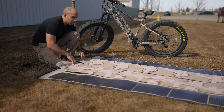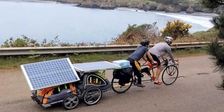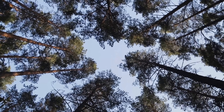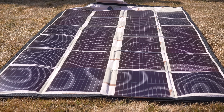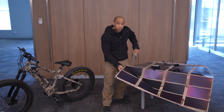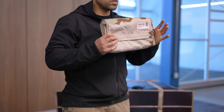Power Film is a high upfront investment. The number one benefit of a Power Film solar panel is that it's going to function in low light conditions. A lot of those monocrystalline panels — if you had a bike trailer system with one of those panels laying flat and you were biking through canopies of trees — that partial shading is going to drastically reduce their efficiency. However, with Power Film, the way they're wired and configured, this is going to perform very well in low light and partially shaded conditions. Even if it's overcast, this thing will still put out a lot more power. The only problem is it takes up a larger surface area. A 60-watt monocrystalline panel will only take up about half the space you see here. So this requires more space, but you get what you pay for.